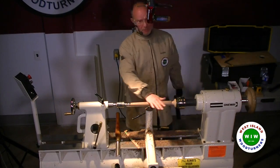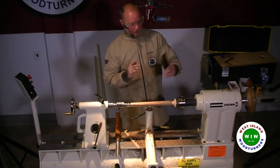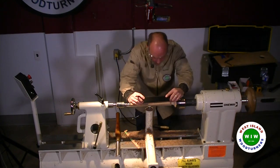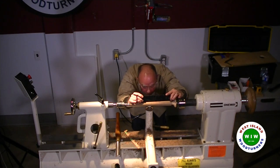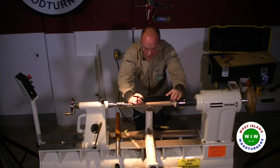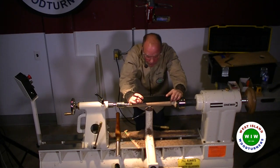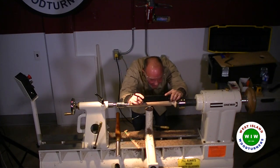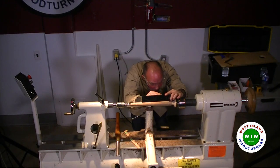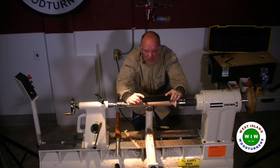So now it's supposed to be a straight taper, right? So I want a straight taper, so I got a straight edge, right? Which is a machine straight edge. And then what I do is I'll look through to see where any high spots are. Now I don't know if any of you can see that. Probably harder when your eyes are closed, but I know you were squinting to see it, right?